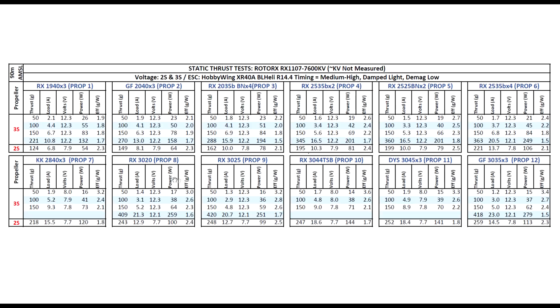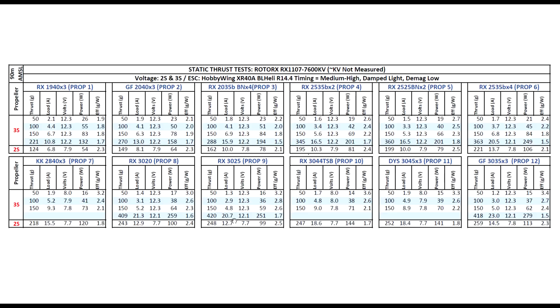I'll link it in the video description. Anytime I see one of these little motors pushing 400 grams, that's pretty impressive. Any motor that pushes 400 grams with decent amp use should make for a very good motor on one of these micro quads. On 3S this motor compares pretty well to motors in the 1106 class size, so this should be a very good option for a lightweight build on 3-inch. Looks like a pretty good option for a PD Micro Quad. I hope you find the data useful — until the next video, thank you for watching.